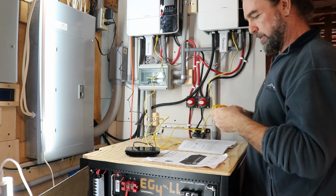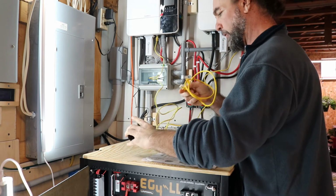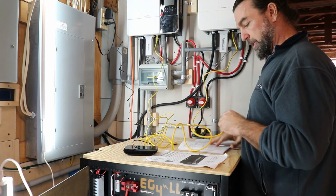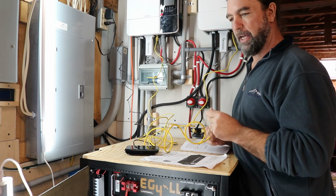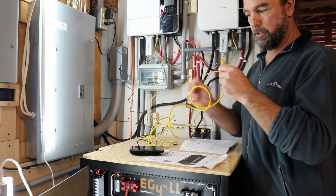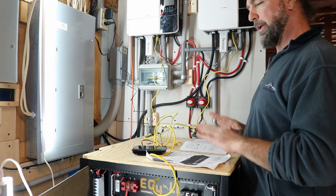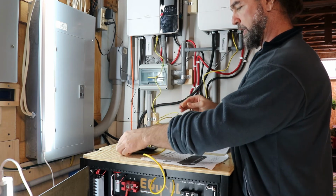On this other cable, we are going to run directly down to the RS-485 port of our number 1 battery. It actually won't be number 1, it will be labeled as 0, the address reserved for communications of the inverters to the batteries. I'll show you that in a minute. We'll connect this one to the top battery, which I'm going to use here, which will be my number 0. Now that we have the cables in place, I'm going to reset the switch here just in case.